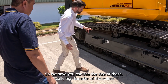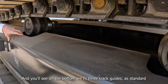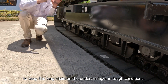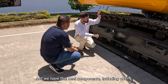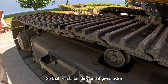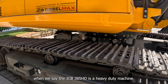You can see the size of the really big diameter upper rollers, taking all that force from this heavy machine. On the bottom we fit three track guides as standard — the competition only fit two, but we do three on this machine to keep the long chain on the undercarriage. We have the best components when it comes to chains — these are thick track plates, thicker than the competition, which resists bending and gives extra wear properties to our undercarriage components. We mean it when we say the 385 is a heavy duty machine.